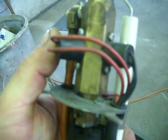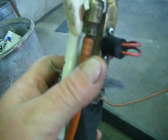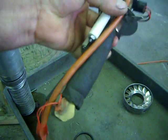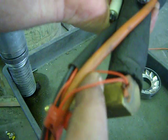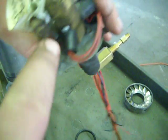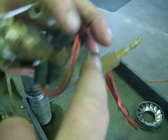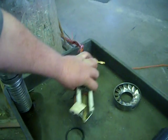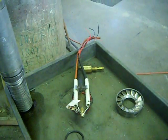This red wire switch here runs power to the electrical heaters inside the nozzle here and inside the elbow. There are two electric heaters, just small 30 watt heaters, that keep the nozzle warm. And the black wire switch here keeps the flame from firing until the nozzle is warmed up. It takes about 7 minutes for the system to warm up.